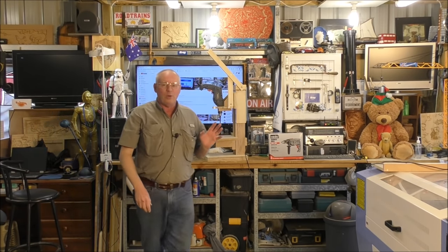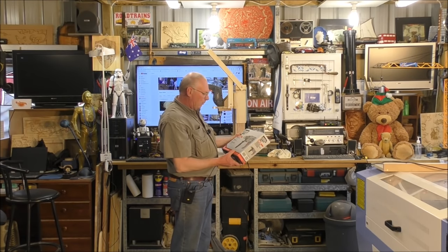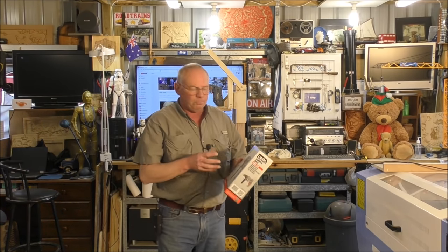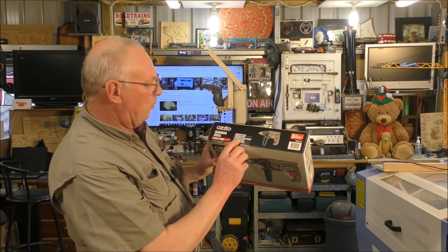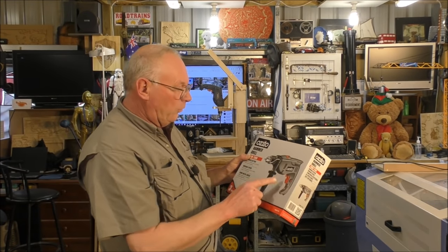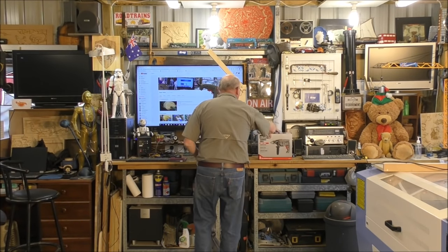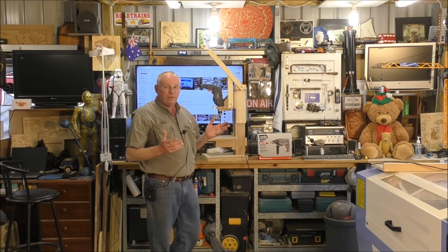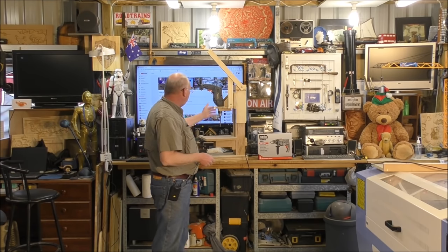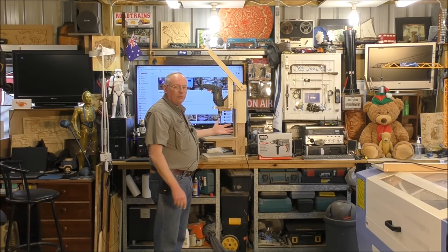Well, I hope you enjoyed the making of this drill press from, I think it was $49. I do recommend getting a hammer drill that has metal gears, and it should be written on the box, whether it's variable speed, up to 13 millimeter chuck, and metal gears inside. So you really can kit yourself out, or adapt your own tools from cheaper tools, on a brand new drill that has a 12-month warranty. And you can adapt it to be something better.